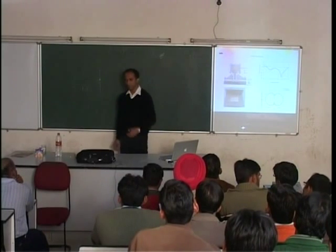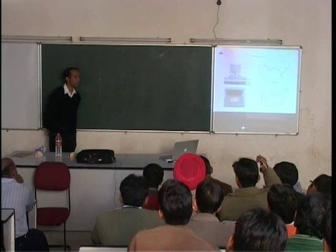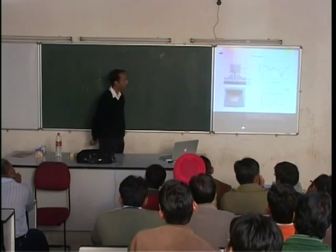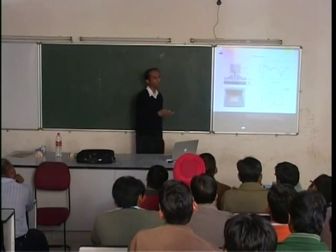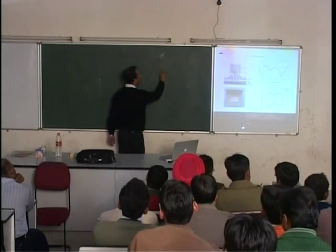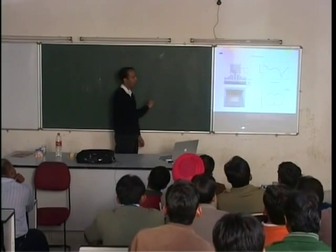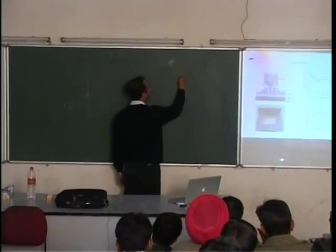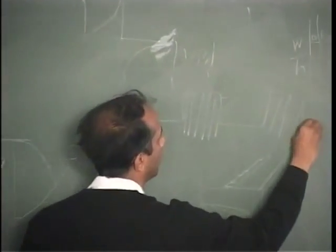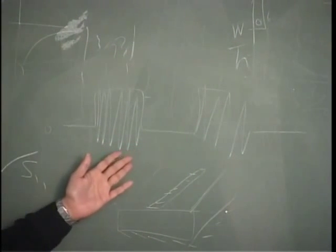Now, this is the standard thinking. That's why we modulate. But nowadays there is another type of thinking. What if we don't modulate? Everybody uses digital signals nowadays. So, if we have to transmit a digital signal, earlier this was my digital signal, 0 and 1, I would modulate it. Then 0 be 0 and 1, I would make this. Again 0, this. And I can transmit that signal. It's modulated. It's called ASK, amplitude shift keying.